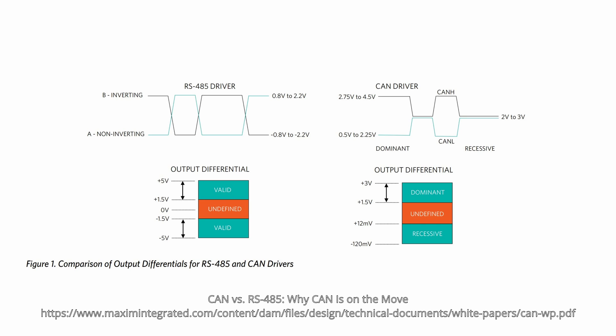So is this CAN bus? No. CAN bus has two main things, and the first is a slight electrical difference. With differential signals we usually have termination resistors on either end, and if the bus is active we're either in a one-state or the other state. That means there's always current being wasted on the termination resistors. CAN bus solves this with dominant and recessive states: instead of fully reversing, the two lines come together to the same voltage, so it's still A minus B with noise cancellation, but now there's very low current flowing.